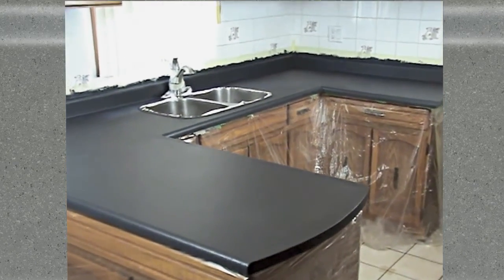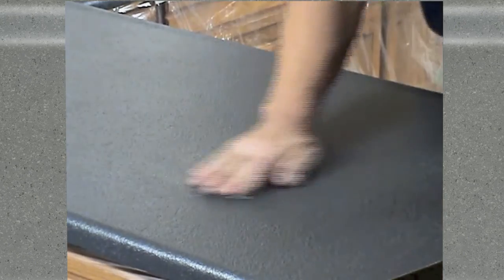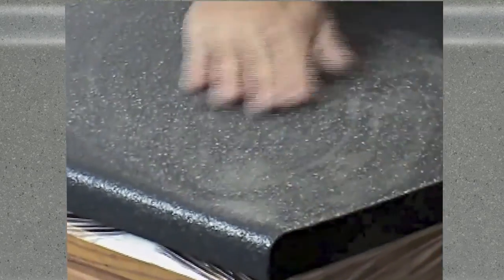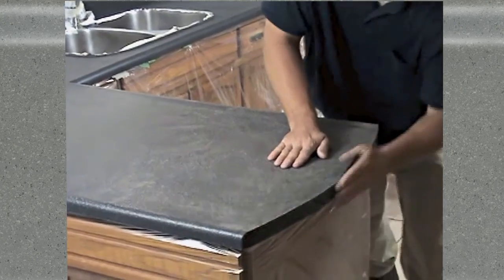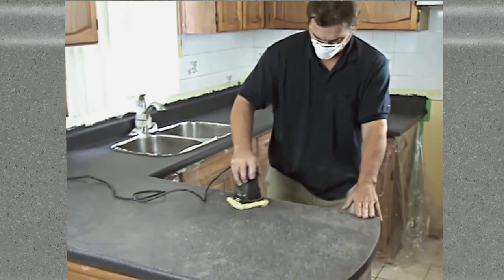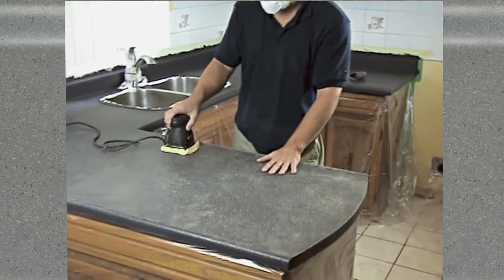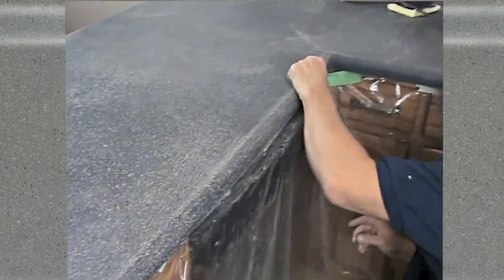Before sanding, put on the dust mask that was included in your kit. Start off with the 80 grit sandpaper to aggressively shave off the most prominent texture in the surface. Sand in a circular motion to avoid any linear patterns or scratches. Along edges, sand the finish more gently, following the contours of your countertop or table. An extra few minutes of care at this time will give you smoothly contoured edges and the results you want. In no time at all, the beauty of real stone is beginning to emerge. If you prefer, you can use a random orbital sander to get the surface to your desired level of smoothness faster. For best control when doing edges, sanding by hand is still the recommended option.